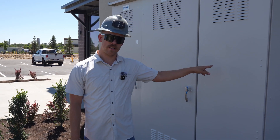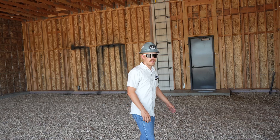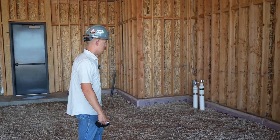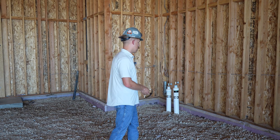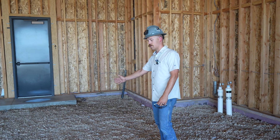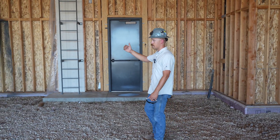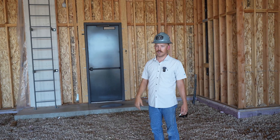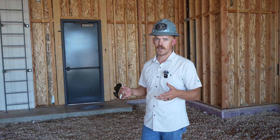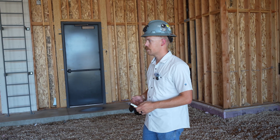Now we're going to go inside and show you what it looks like in there. We've gone underground inside the building already. Inside the building we're just on the other side of the wall from that metered switchboard. After the footing and foundation were poured we ran conduit underground through the foundation and into the main space. There are conduits underground here still that are meant to feed this space and that space — we're going to leave them buried and marked, and when a tenant occupies the space they will uncover them and tie them in wherever the panel is going to be.